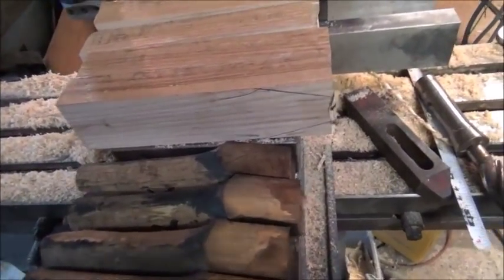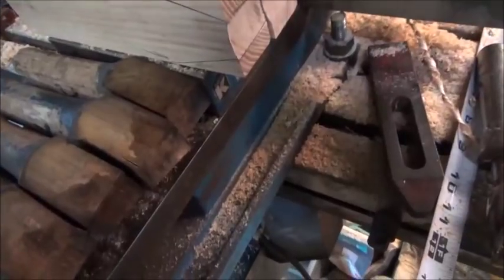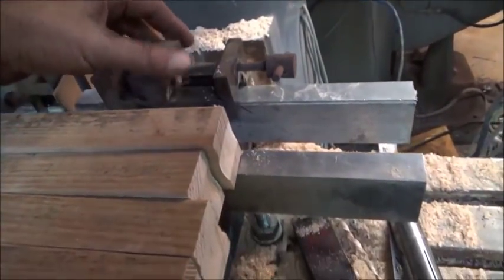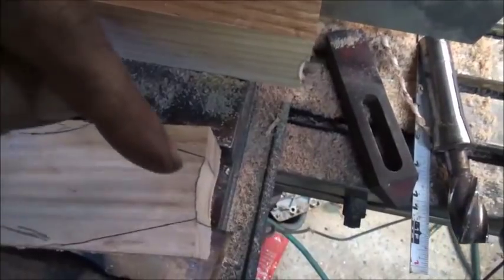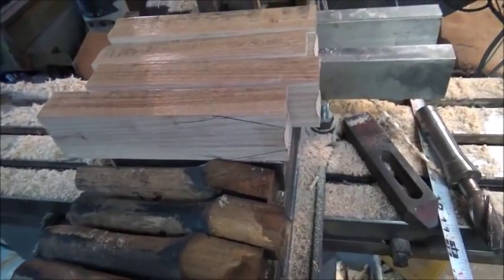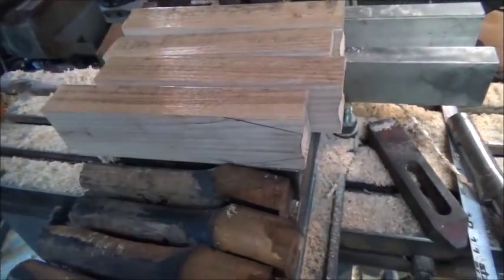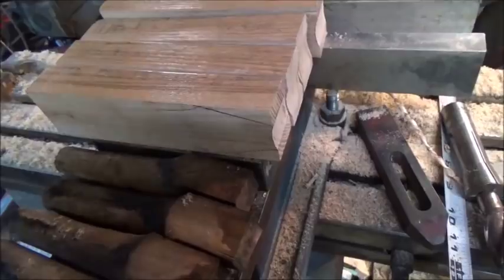I know it's probably kind of short, but I've got some other stuff to take care of. What we're going to do — this is not a swivel vise, this is for CNC machines — we'll take this off, put my swivel vise on and use the machinist vise. That way we can set up our 5-degree angle one way, and we'll set up both angles so we can put each piece in the vise and machine them off.